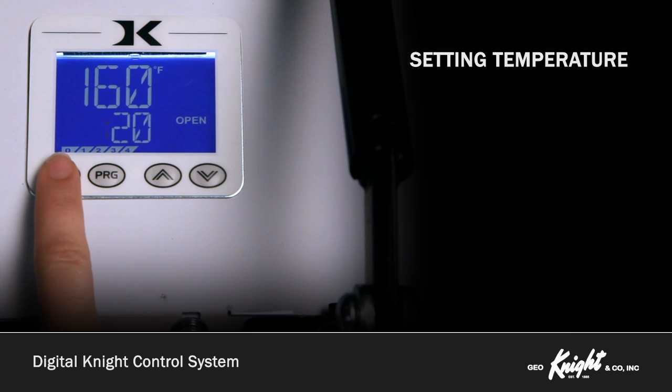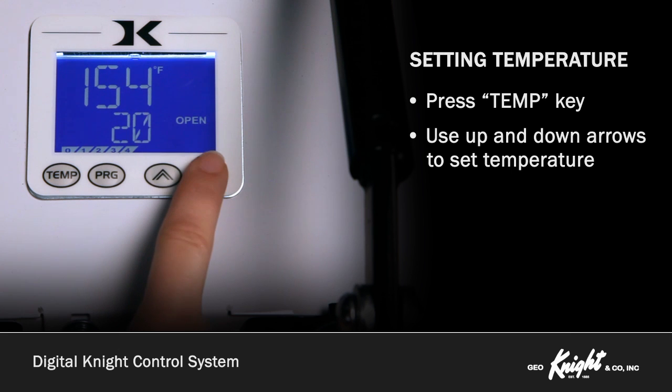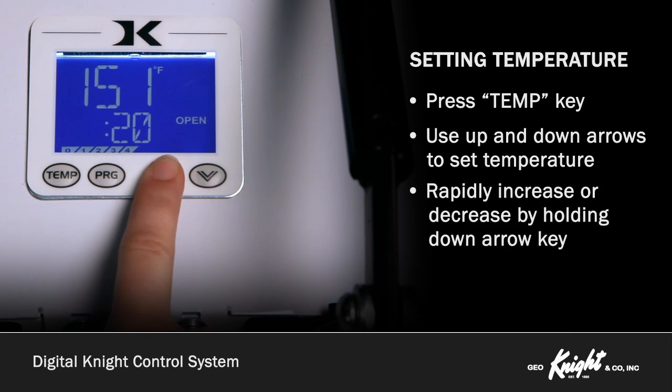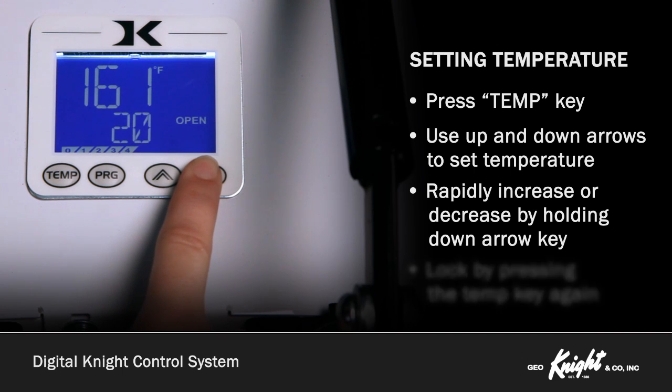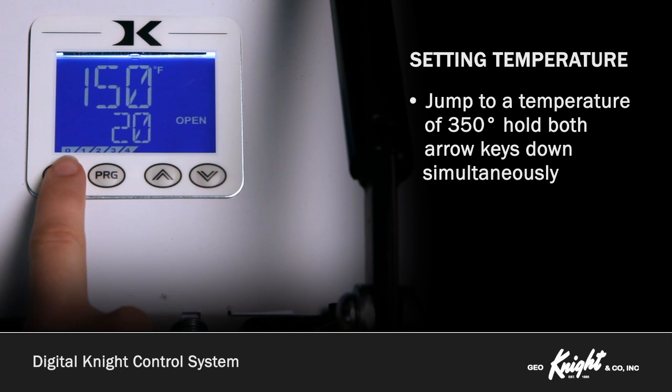To set a temperature, press the temp key. Use the up and down arrows to set the desired temperature. To rapidly increase or decrease, hold down the arrow key for 2 seconds. When finished, lock the temperature by pressing the temp key again. To jump to a temperature of 350 degrees, hold both arrow keys down simultaneously.